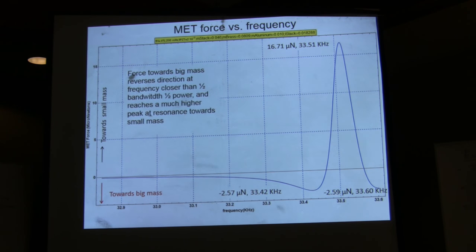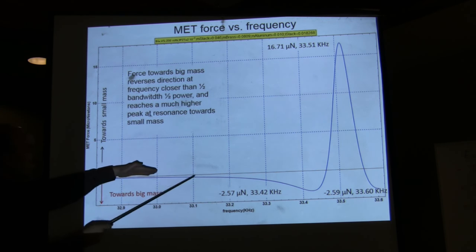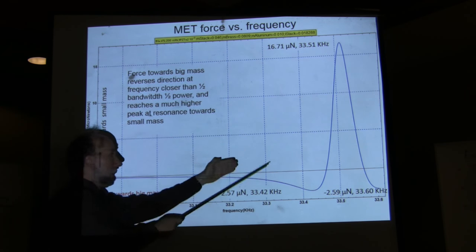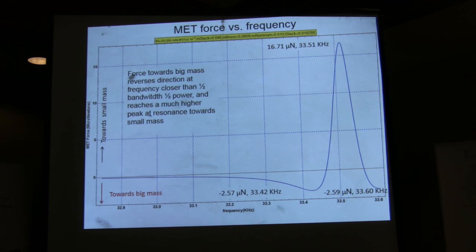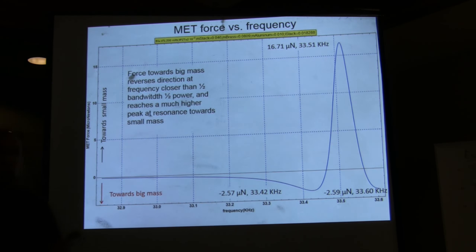But you're not going to measure that because if you don't have automatic frequency control, you're doing this with an operator, and you're coming here and trying to reach resonance, and this thing is resonating here, it's already moving back and forth, so it's not going to all of a sudden shift direction and hit your resonance. So if you really wanted to have a great force, you're going to have automatic frequency control instead of having operators. And like you said very well, this is a thermal effect.